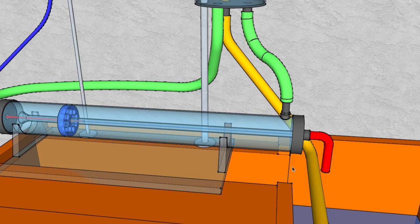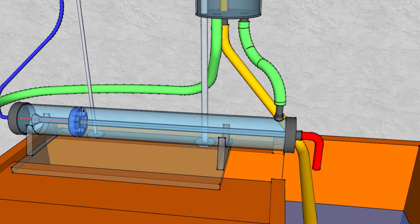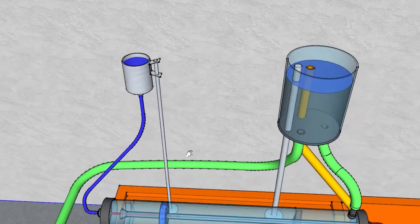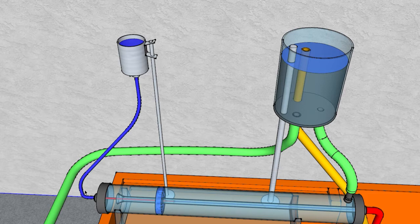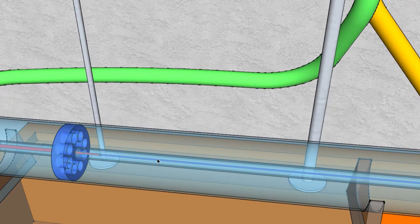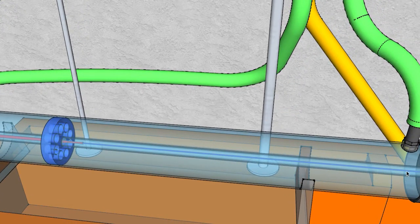The red pipe is the outflow. There is also another small pipe that goes inside the inner tube, connected to the small dye tank. This dye tank has dye in it, which flows slowly inside the pipe until it reaches the opening. When you open the dye, it gives a constant flow of dye inside the water, so you can see the direction and status of the fluid. If the flow is laminar it will appear straight; if it is turbulent it will be wobbly.